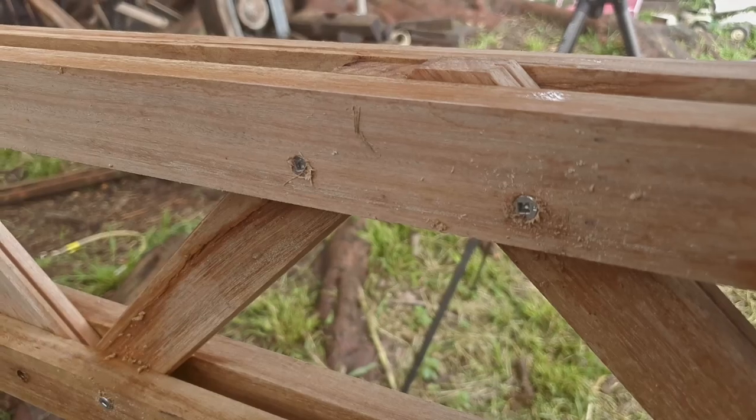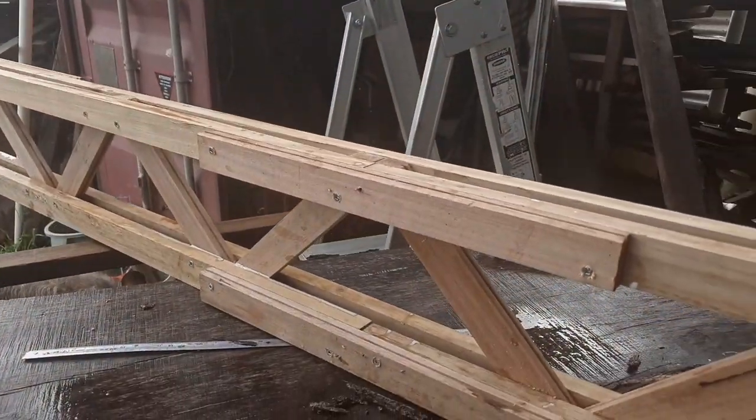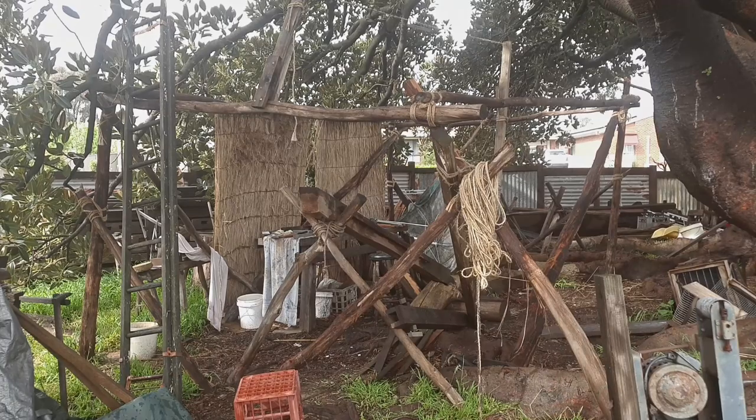Time has passed and much rain has fallen, and I've got the beam finished. I didn't get it on film, but I've added a screw to each piece of the timber from each side and I've stiffened up the joins in the top and bottom cord. Now we've got to get it up on the frame, ready to spread the tarp over it.